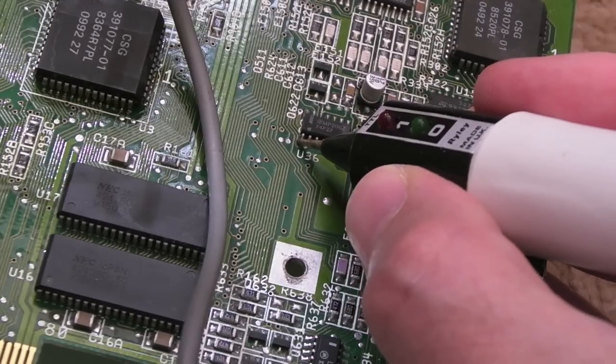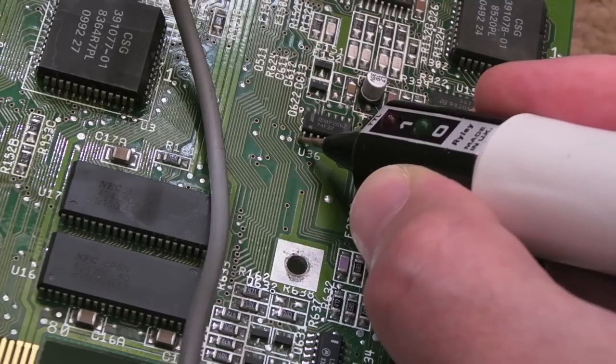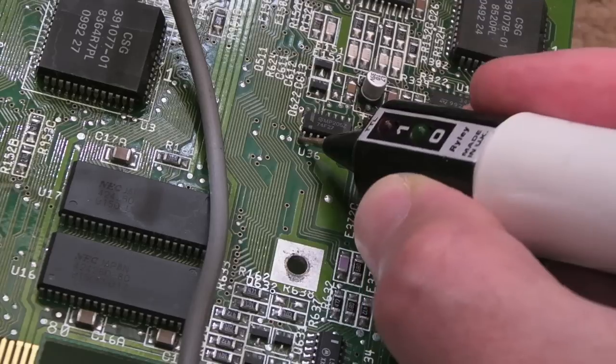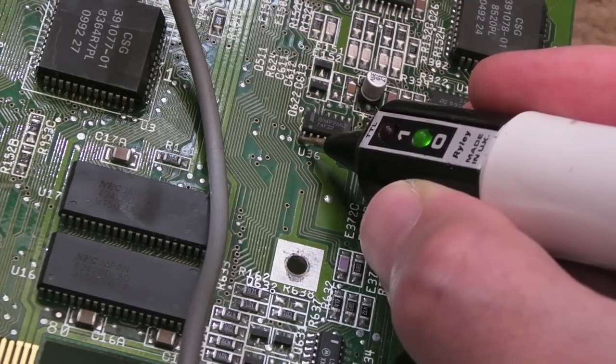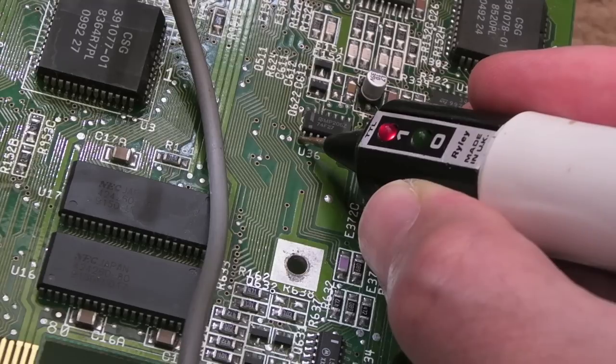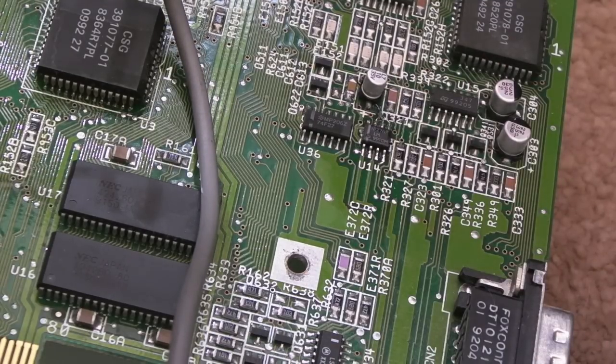If we have a look at the first pin there, this is from the MCU connection, so it scans one of the keys here. If we just power this on, we've got a red screen. Look, it's low. Can you see that? It's low. Low, which means it's pressed, I think. Low, and it's gone high with the black screen. So, oh, this gets even more confusing.